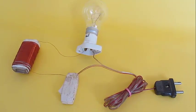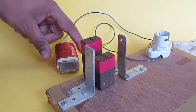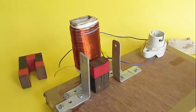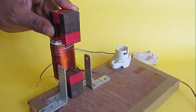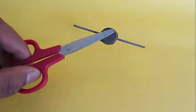You need to connect a 60-watt bulb to our coil in series. This is because the copper wire in our coil has very little resistance, and if we don't connect a load, it will essentially short our power supply and the coil will burn. After inserting the coil in one of the iron cores, insert the other iron core on top.